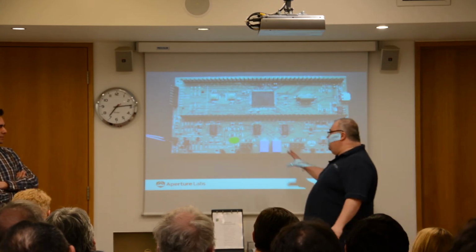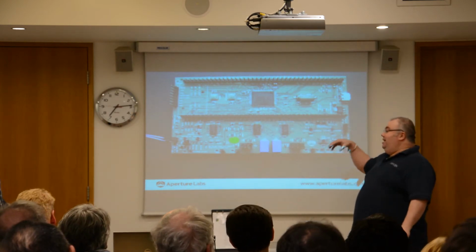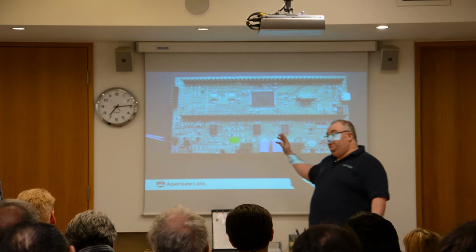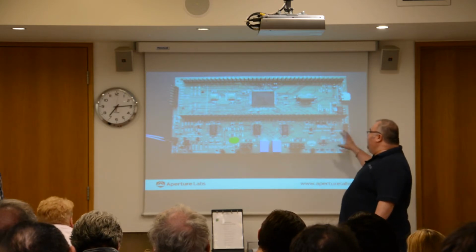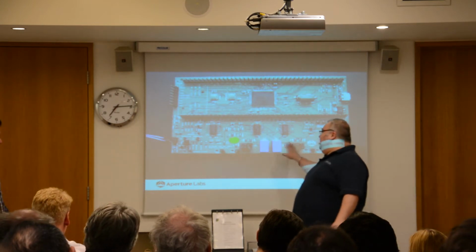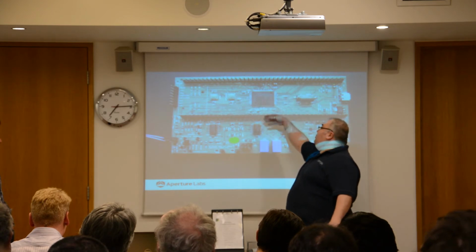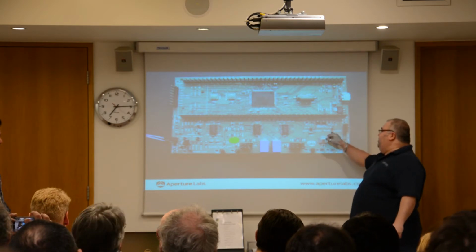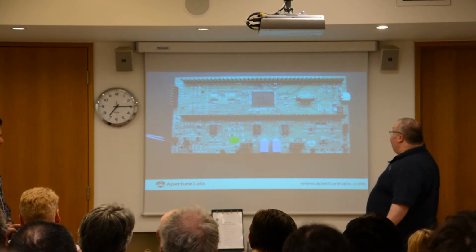So a lot of the main challenges were in the analog front end, because it's not just a reader, it's an emulator as well. It's also a sniffer. So the trick was integrating a lot of this stuff without messing up our analog signal. And again, trying to lay everything out to make sure everything has reasonable spacing. It's not actually very tight when you don't have your headers in place. It's all nice and flat, gives you lots of access to solder things like the large PIC chip here. And again, we've tried to avoid small chips like this. However, some were unavoidable, but these have the same or larger pitch than the PIC.